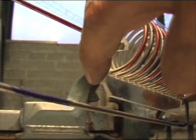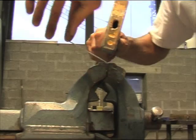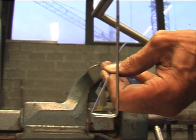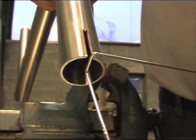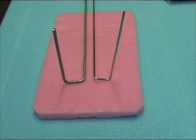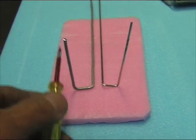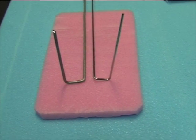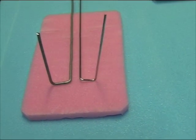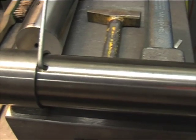This is what you get. In order to do this kind of shape, I'll show you how to make it. You take it this way — it is like this, two times 90 degrees. The reason for all this is that you put your wire in here and you have the possibility to turn around. You can bend your wire towards the right and up or towards the left and up, depending on how you bend it — it decides on which side the coil will be turned, left or right. That allows me to turn right ways.